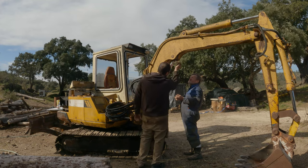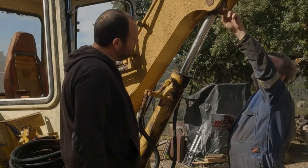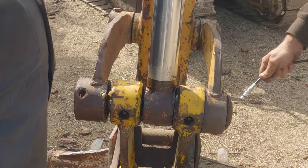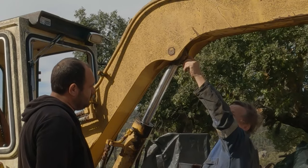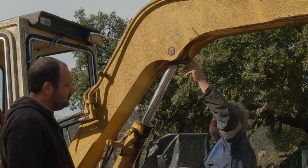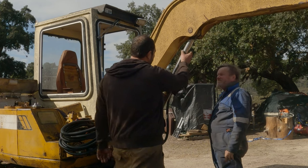When you pump grease in, you'll see it come out — a little push of grease coming out at the joint. If you're greasing it once a week and you're seeing a little piece of grease coming out, that's good. On a machine you've been using for months you want to see grease sticking around the joints. If you come to buy a machine and it's all spick and span, bone dry, nothing — you might wonder whether it's been greased, maybe just been pressure-washed. But grease is the cheapest maintenance you've got — prevention is everything.